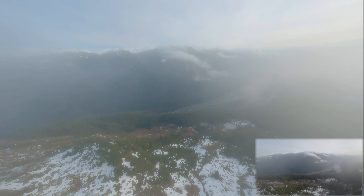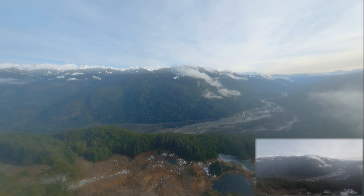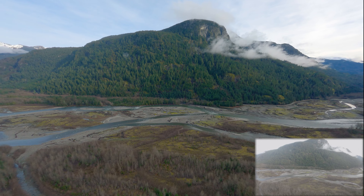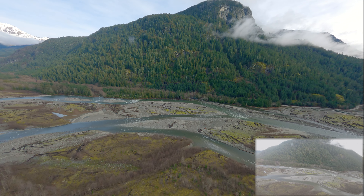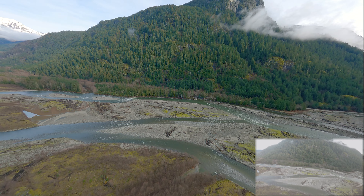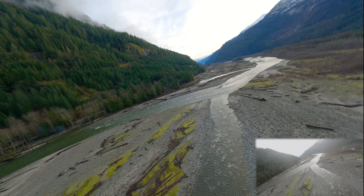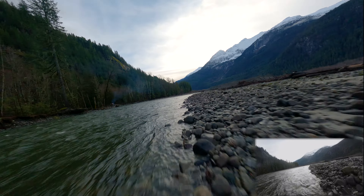When comparing it to lithium-ion packs, lithium-ion packs never really put out their full capacity when flying on a quad — they're usually rated at full capacity when discharged at very low amperage. Now that I'm almost back down to the river, this is my first time flying this pack. I'm going to fly around close to home and burn off the milliamp hours to see how the battery performs as it gets near the end of its capacity. Lithium-ion packs sag really badly near the bottom, but this LiPo is performing quite a bit better than that — I really quite enjoyed doing this flight with it.